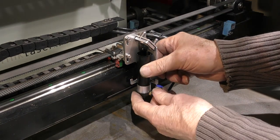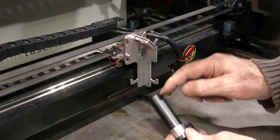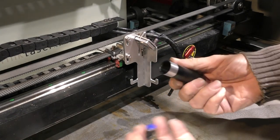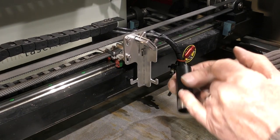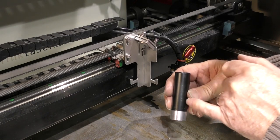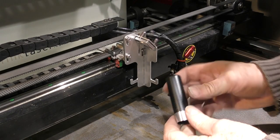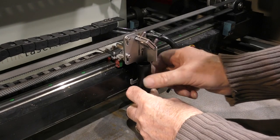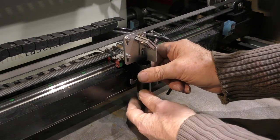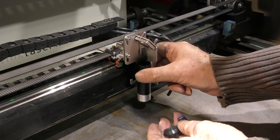And I'm intending to get a set of lenses in lens tubes so that the only thing that I've got to do is to change nozzles. So the lenses will already be fixed in here and I'll probably engrave what lens I've got on the side there. But I can put a sticky label on there now because I haven't got to slide it into a lens tube. The sticky label can sit on the side here out in fresh air.